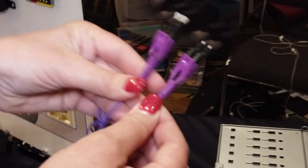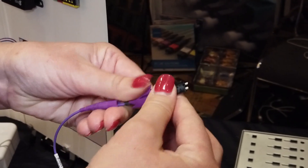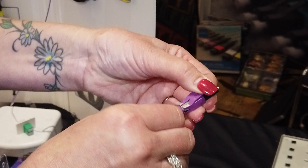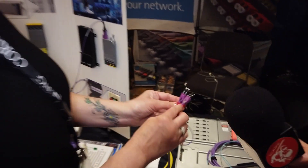One of the things I've seen in data centers is occasionally human beings get the transmit and receive sides mixed up. That can be a human mistake, but it can also be different modes of operation or different requirements for the equipment. You have a little trick for that — this is a reverse polarity patch cord. What's nice about it is we can pull the boot back, push the clip back, and turn these connectors around, then flip it back and push the boot and clip back up. Now we have reversed the polarity. The silk screen here is going to be in opposite directions, and the arrow on the black one shows we've reversed the polarity on one end.